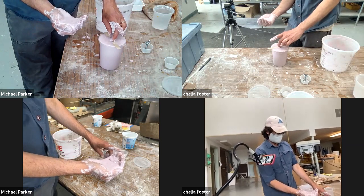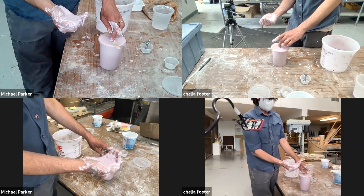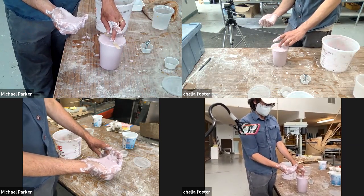Alginate deteriorates over time and often you have to break it apart to open it up. Molds change. Sherry is now going to be making a third cast using a technical plaster — what's known in the industry as a statuary grade, like a 10,000 PSI plaster. You have to use a drill to mix it — it's by weight. It's really a technical plaster that can do things that pottery plaster or hydrocal can't do.